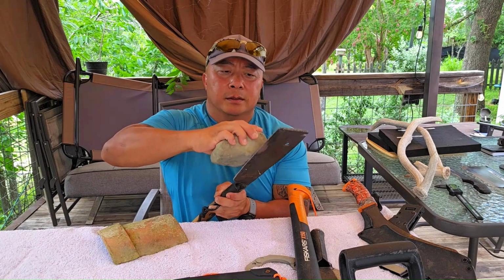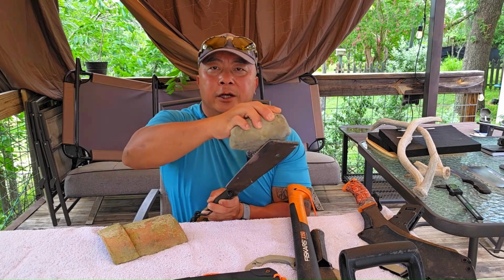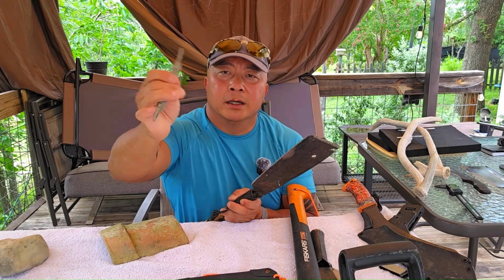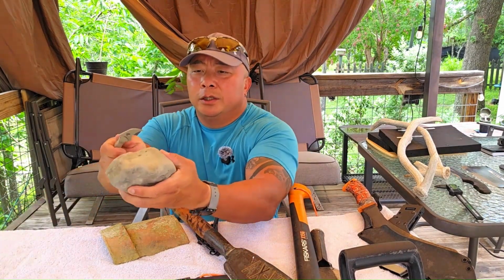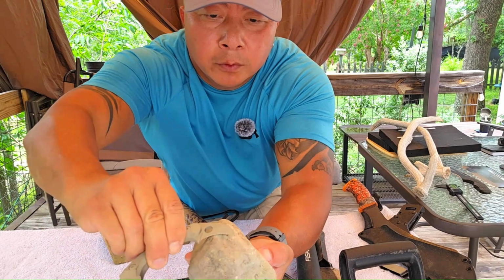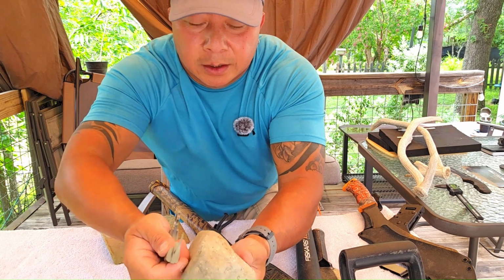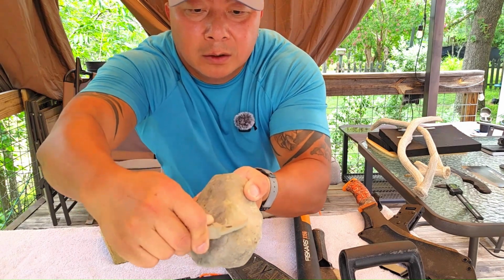It's real easy, real fast, because I'm not trying to survive so I can play with my knives. My knives are there to help me survive. So if I have a concave blade, like a sickle or scythe, it's much more complex to do a quick sharpening, because with this bend in here you need to be very careful, as you're bending it out, that you're not changing the blade angle and messing up your sharpening. So you're gonna have to go like this and go like this.